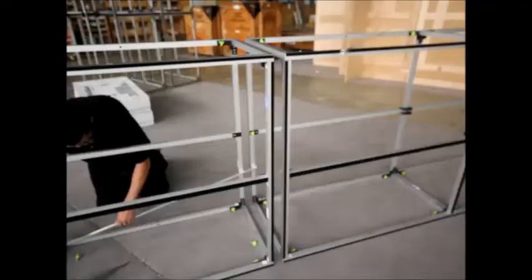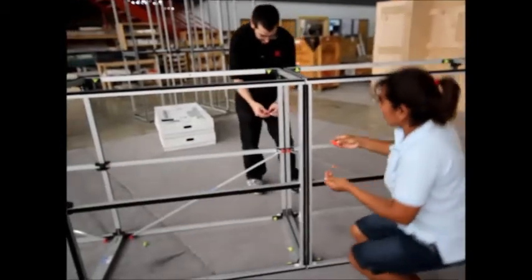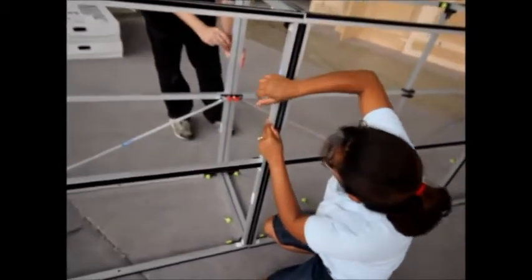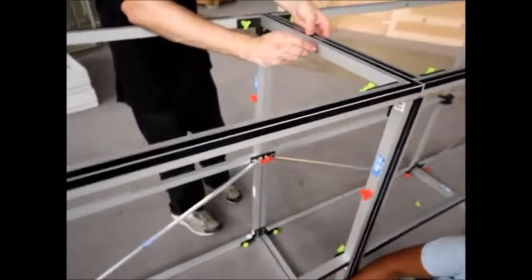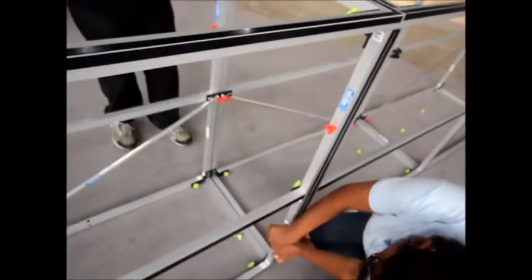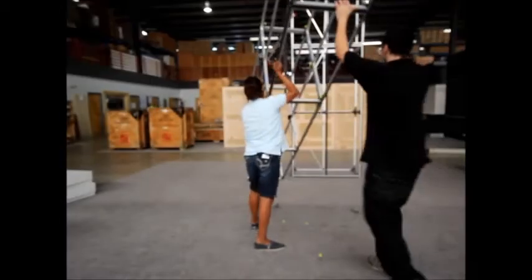For the 16-foot tower configuration, diagonal crossbeams must be attached to provide additional stability. These diagonals are marked with orange stickers. After attaching the diagonals, lay the fully assembled towers flat on the ground. Attach the 8-foot towers together with red thumb screws to complete 2 16-foot towers. Attach these towers together as one unit using the red thumb screws.